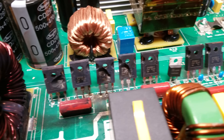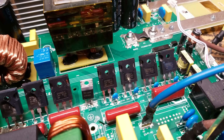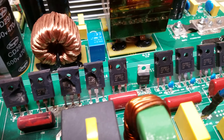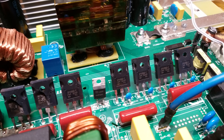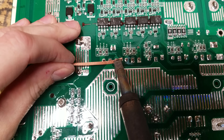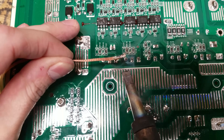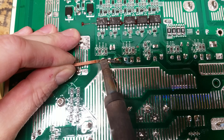The first thing I want to do is remove all nine of these MOSFETs from the circuit board and test them individually to make sure the ones that are not blown apart are still good. You can't always tell by physical appearance whether or not they are damaged, and I don't want to risk several $12 transistors because I fail to check the others and ruin the new parts. The way I'm removing these solder joints is with standard solder wick — when you heat it up it pretty much just soaks up the solder. Very carefully put the wick over the solder and apply the iron. You can see how that wick is unsoldering quite a bit of solder, and there are nine MOSFETs so it's going to take quite a bit of time and solder wick.